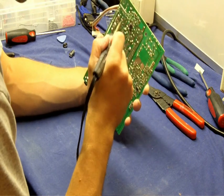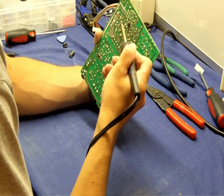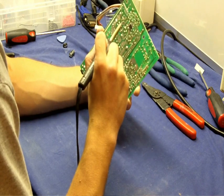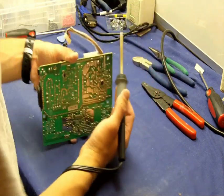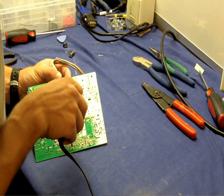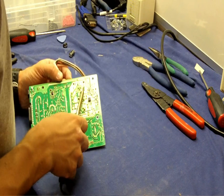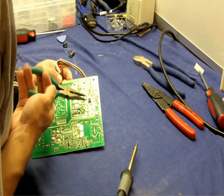The capacitors I ordered are from Digikey. The actual capacitors were around $4.95 with about $10 shipping. They are by Nichicon — 1000UF 10V capacitors. I have seen others online replace them with larger ones, but I'm not an electrical engineer so I won't dispute that. I know they use 1000UF 10V radial capacitors in this Dell monitor. From what I understand, they just put a cheap brand in it, which caused the problem, so I'm putting in a better capacitor.